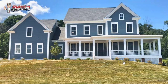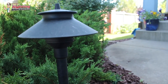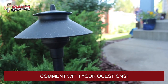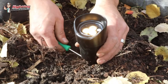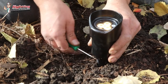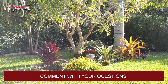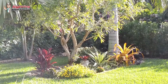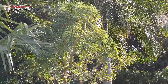Basically, the way I light something like this is using two kinds of lights — our two most popular: up lights and path and garden lights. I don't like to use a lot of path and garden lights but they work well in an application like yours. There are a couple areas with higher peaks where I'll use a 5-watt LED instead of the standard 4-watt — that's a 35-watt equivalent lamp — just a little brighter to push that light up. I'll also talk about some gutter mounts for second-story lighting.